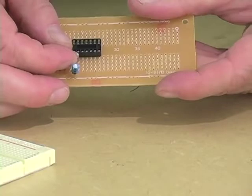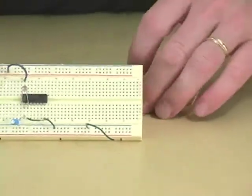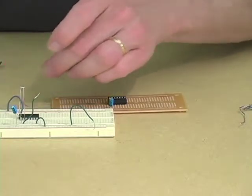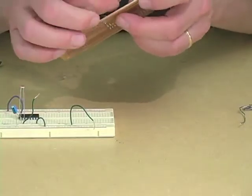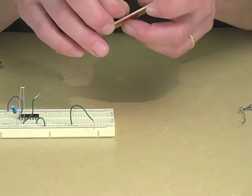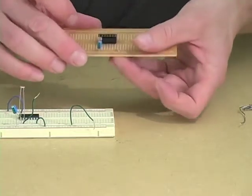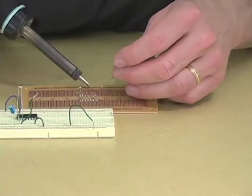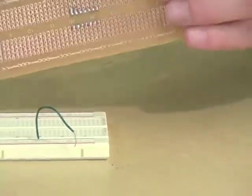So now we have the capacitor and the photoresistor, but we don't have the power connections yet — power connections from pin seven to ground and pin 14 up to plus. But we do have these little bits of wire cut off from the legs of the photoresistor. We can use these to make our connections between the power supply pins and the bus — this saves us having to strip some wire. Just use a bit of the bare leg we cut off. Turn the board over, solder it, and there is our ground connection. Cut off the excess wire.